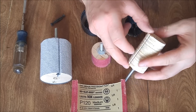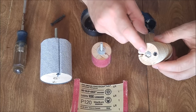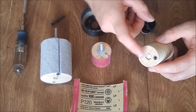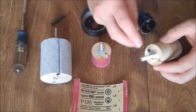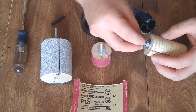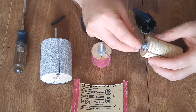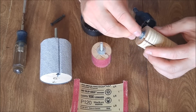What I use is a quarter inch hex bolt — the head of the hex bolt is recessed into the top disc to lock it in place, and then there's a washer and a nut down at the other end so that bolt's not going anywhere. This is where you lock down to either your hand drill or your drill press chuck, so it holds it really well and it's not going to come loose.